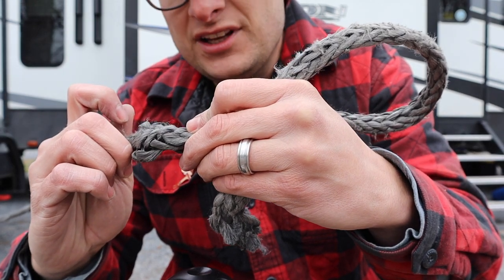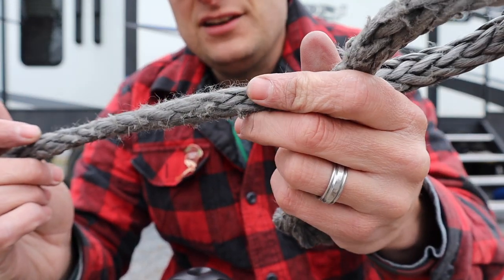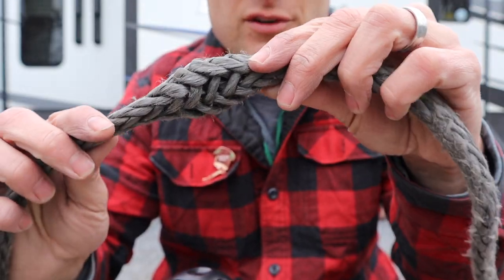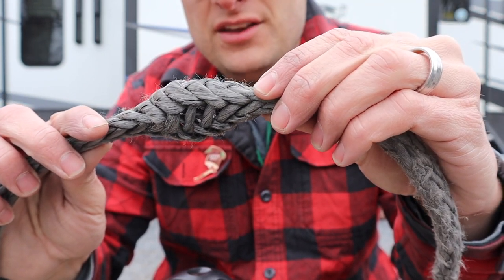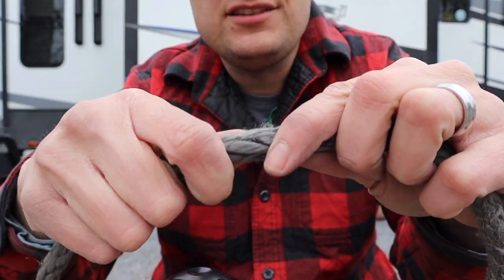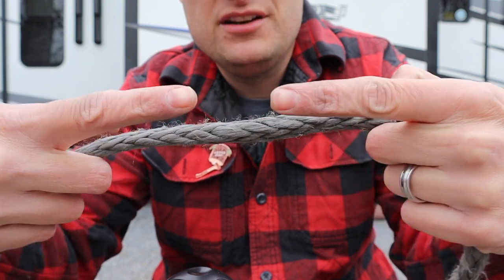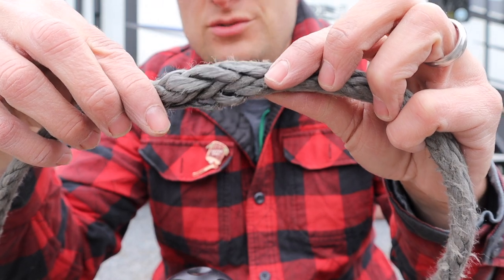By doing that, we don't use any kind of knots. You're not supposed to knot your lines up anywhere — if there's a knot, you're really decreasing the strength in your winch line. The center of this rope is a channel and we're going to put the end of the rope down through. Then with tension, what actually happens is the winch line kind of grabs around itself and holds it in place, very much like a Chinese finger trap. When you put them in and pull them out, it's kind of tough. So let me show you what we're going to be using to do that.